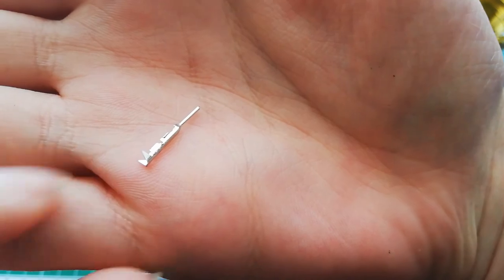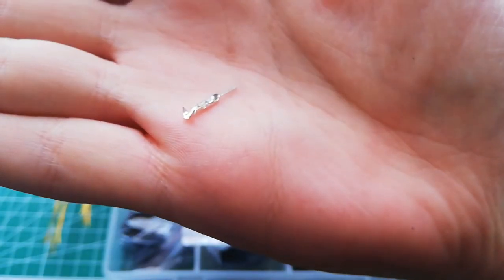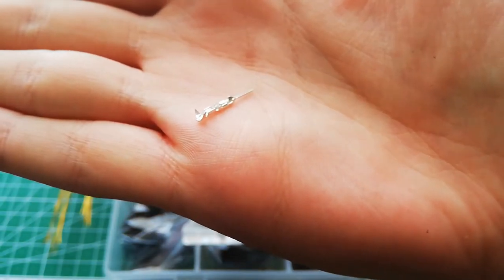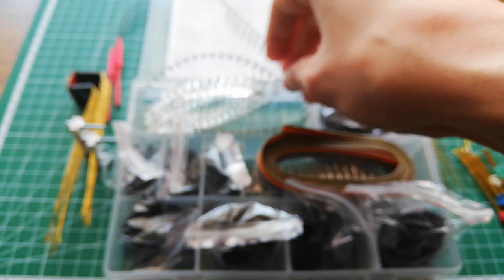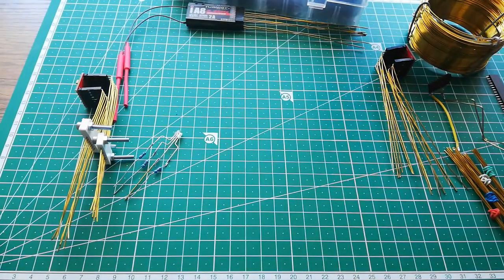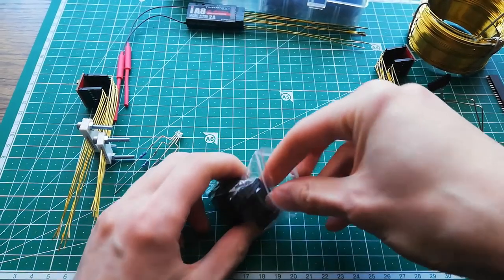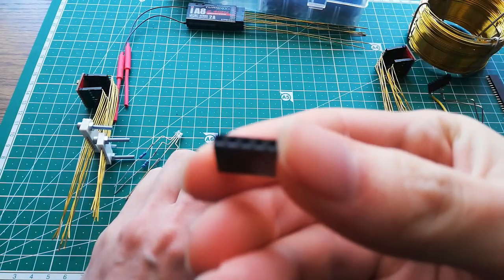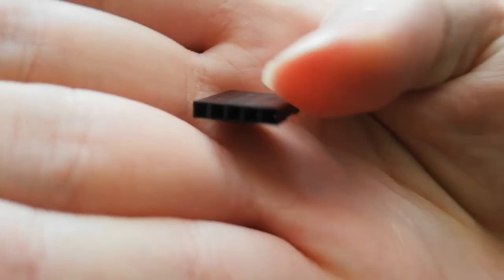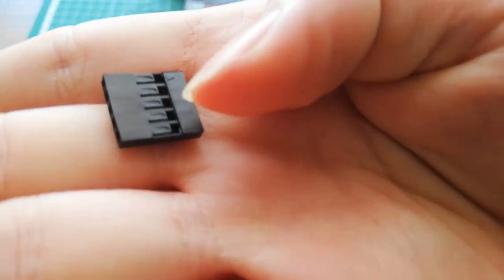And it's really difficult to see because it's so shiny. But yeah, this basically holds a wire inside, and you just crimp it together. It's basically just jammed into the wire. It works quite fine. It's just a little bit iffy, and it takes some time, and once you're done, you just take one of these headers, and they come in different sizes as well, to just stick those little ends in. Maybe if the camera wants to focus like this, yeah. So you just stick them in into the broadside and they click with these little flaps.